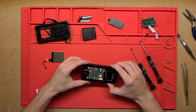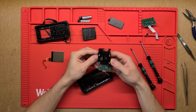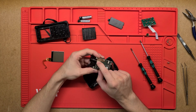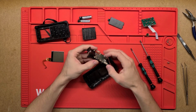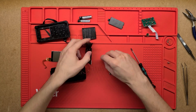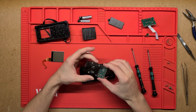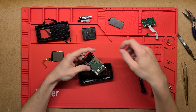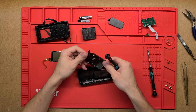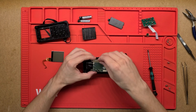All right, so the main PCB - let's see if we can take this off. It's got a laser over here - this whole thing might just pop out. There are a couple more screws. The laser is just a little red laser pointer soldered directly onto the board and glued to the case, which is then screwed down. The plastic case holding everything together is screwed directly to the PCB that holds the laser pointer, so there's a mechanical connection through the electrical contact as well. I'm going to put those screws back in so I don't break any of those fragile pin connections.